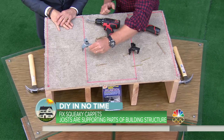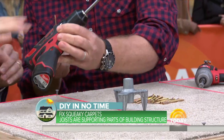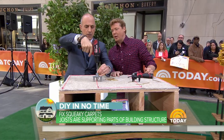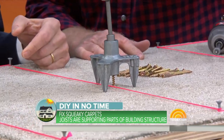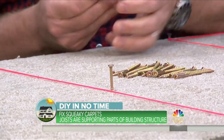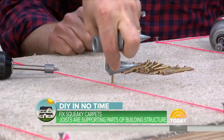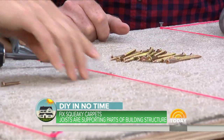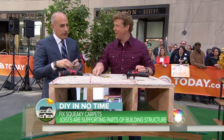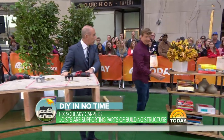But you've got carpet down. So now we've got this contraption, 20 bucks at the home center. It comes with a screw that will automatically snap off. Put the screw right on there. You're going to set this right above the joist, which we've already identified. Put it in and just keep screwing — you can't go too far. Push it all the way down, and that's it — it stops itself. Now you've got a little attachment; you're going to go into the screw, wiggle it back and forth left and right — that's going to snap off. You can actually counter-set that; it will go down below the subfloor. 20 bucks — that's the squeaking fixed. That's an hour.